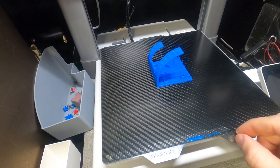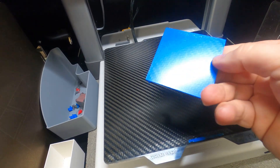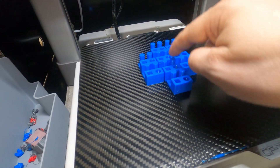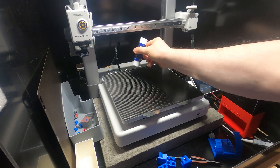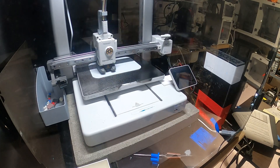For PETG, the guide says we don't need to do anything to the surface. After the PLA print, I used IPA, cleaned it off, got rid of all the glue stick, and did the mini calibration test — and as you can see, it printed just fine and didn't come off the bed. Success. I then did a bunch of the same model all around the center, just to see if anything would go flying off — no issues whatsoever. Next up was ABS. As recommended, it requires glue stick, so I cleaned the surface with IPA, applied glue stick all over it, and started the print — one of the little storage trays — and it printed perfectly fine.